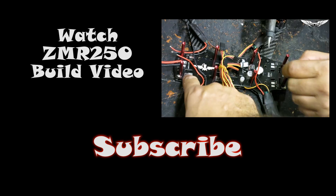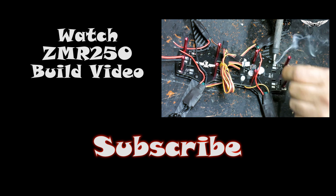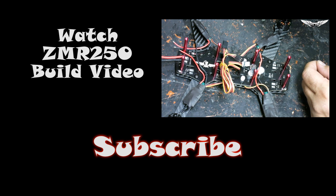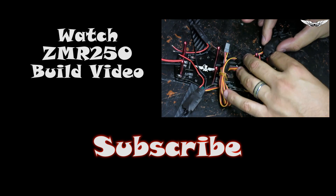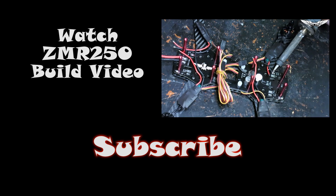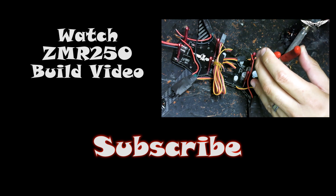What we're going to go ahead and do is cut the wires down to length just so they reach the solder points. Then we'll tin the solder points a little bit with some solder, and then tin each one of the leads from the ESC — the positive and the negative — and solder them down directly to the board. This will ensure a nice clean setup. What I like to do usually is put the wire down on the PDB board and hold it down with the solder, then find a pair of pliers or a screwdriver to hold it down.